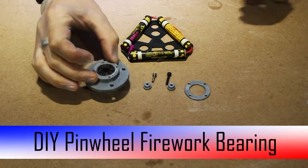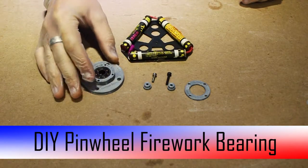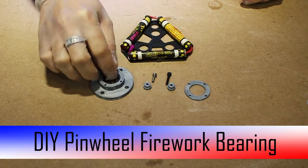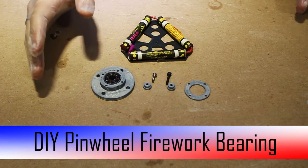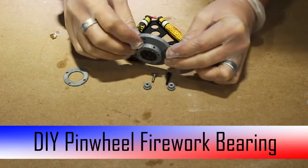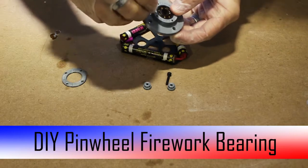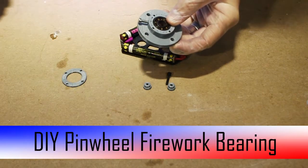Now I've already pressed this thing in here. My printer for whatever reason printed this hole just a little bit oblong, and so it didn't quite fit, so I've gone ahead and pressed that in with a vise — do that however makes you feel comfortable. There are a couple of retention methods, the first and easiest one being this little hole right here. We can go ahead and put a screw right in the side here and just thread it into the plastic.